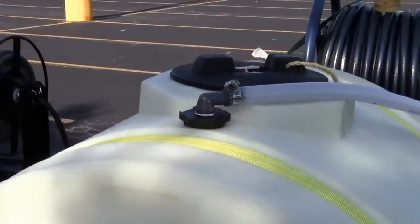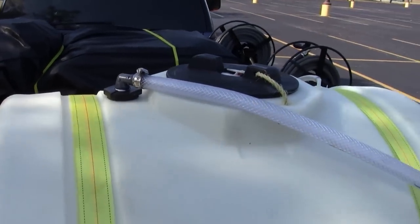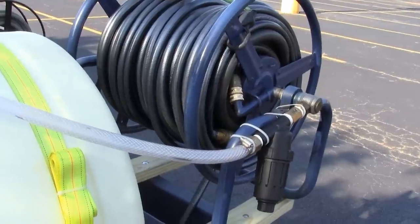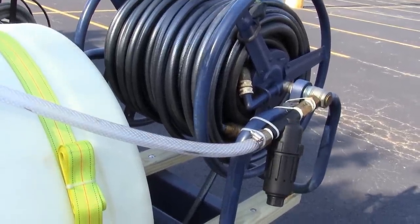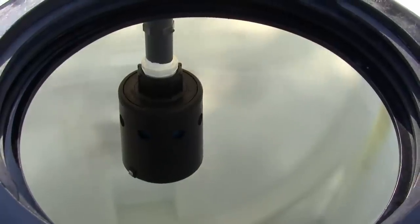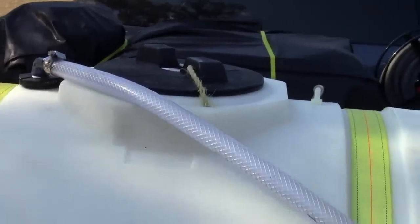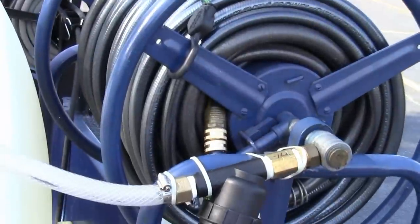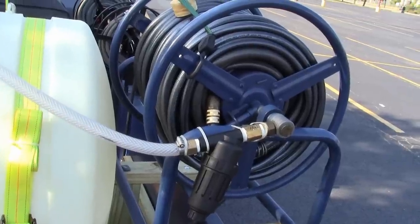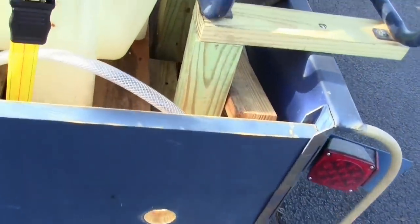This is the three-quarter bulkhead I put in for the Hudson float valve, which runs to the fill reel — a hundred feet of three-quarter hose at the bottom and then a hundred feet of five-eighths hose. There's also a little plug I cut out for the drain tubing to go out if I need to.